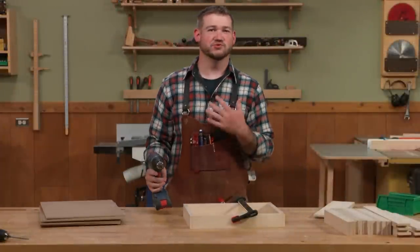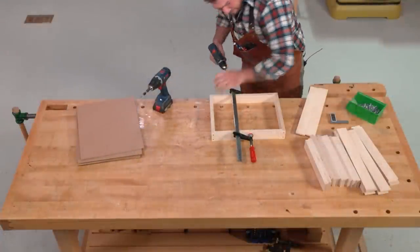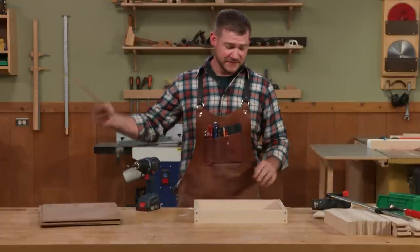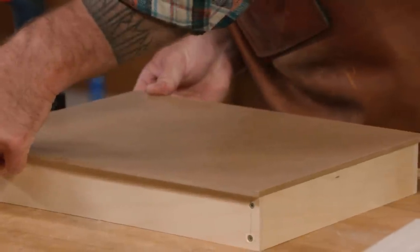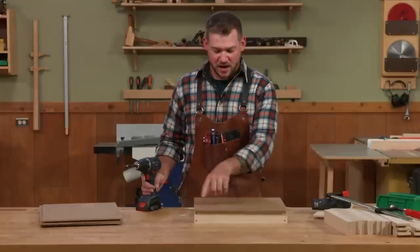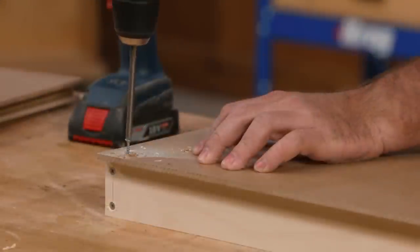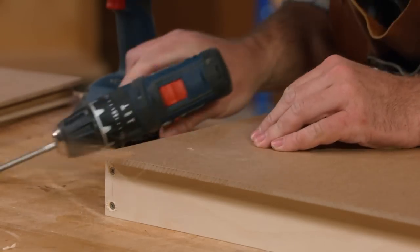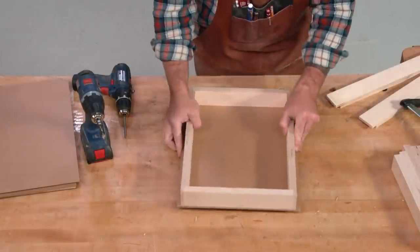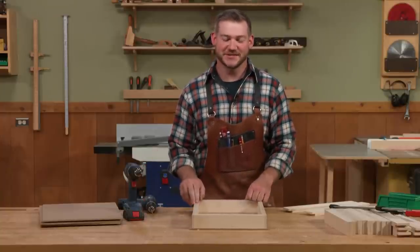There we go — now we just have to drill two locations on each joint and drive a couple of screws. So there's one of our drawer boxes, and now it's a simple matter of attaching it to our hardboard. We can do that by centering the drawer up on the hardboard and driving a screw — one in each corner and maybe one in each center location. That's some quick and easy drawers. I'll do this a handful more times, then it's off to add a little customization and organize these how we want them.